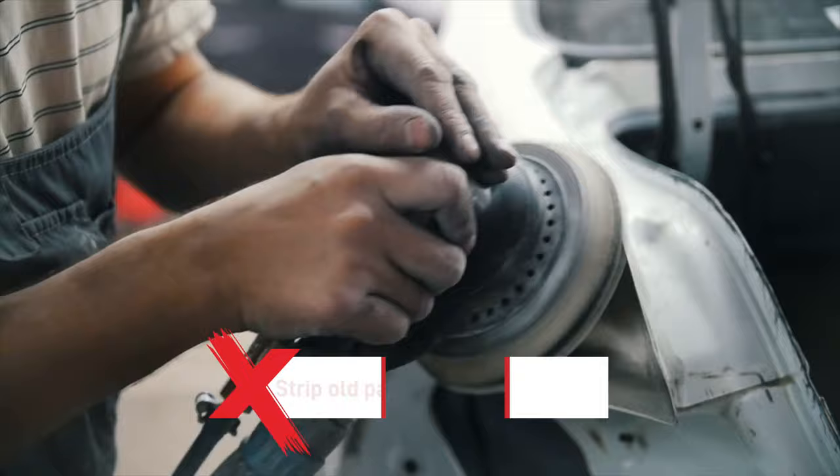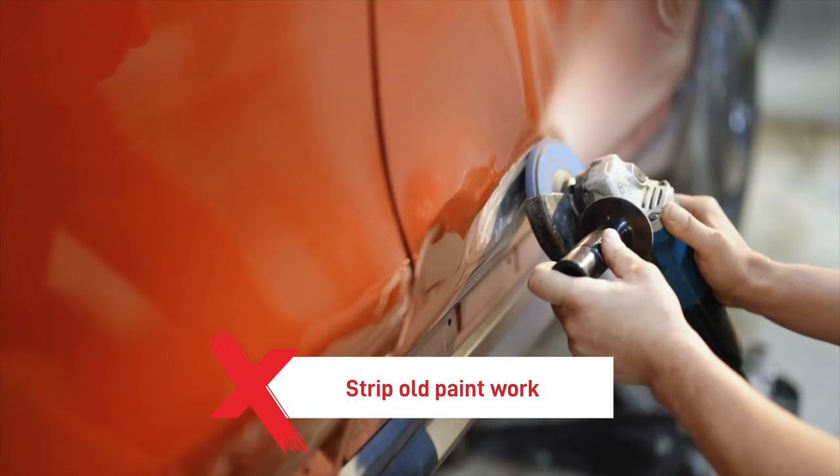Stripping can be done by manual or mechanical sanding or by sandblasting. Mechanical or manual rust removal produces a much lower quality than blasting and will usually result in a shorter protection period of the applied paint and can affect the adhesion of the primer.